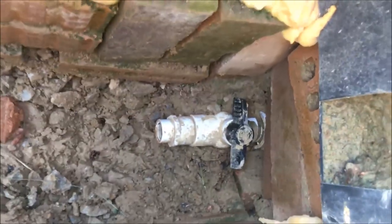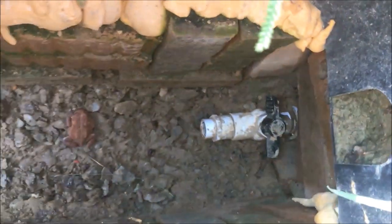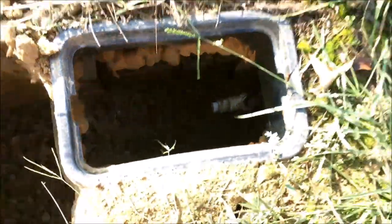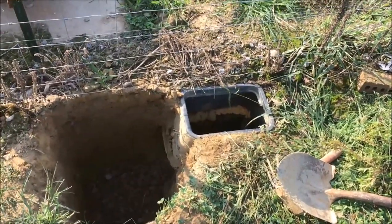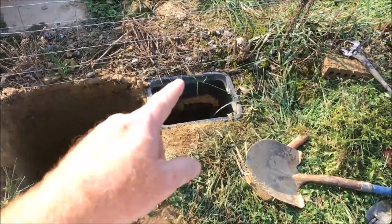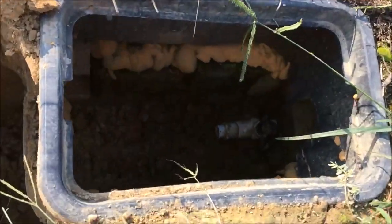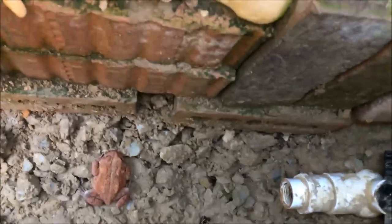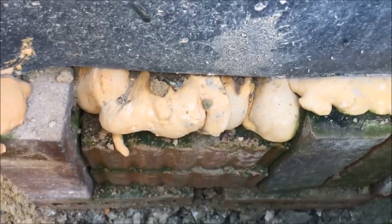There's that original piece. Another important point — you can see the valve right there. Anytime I put any plumbing fittings outside — hydrants, branches to hydrants, whatever — I always add a valve so that I can shut water off independently and not have to turn off water to the house. Right now my water to this is turned off but the house is still on, so my wife and kids don't fuss at me about how quickly I have to get the project finished. You can see down in here that I've got bricks on top of bricks on top of bricks. The spray foam there is really just to keep the dirt from falling in back when I first installed this box. I wanted this hole pretty deep — they just don't sell these plastic boxes deep enough to do what I want.